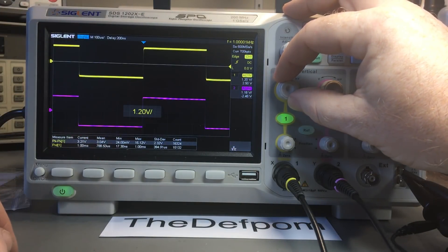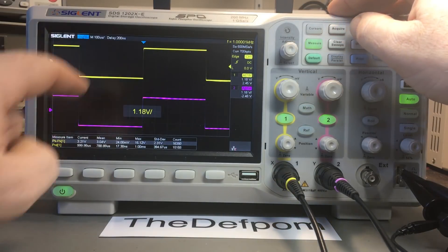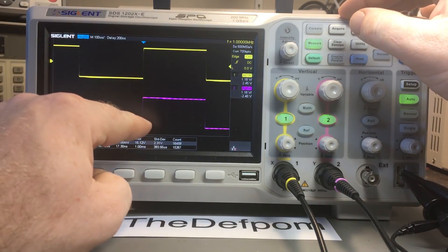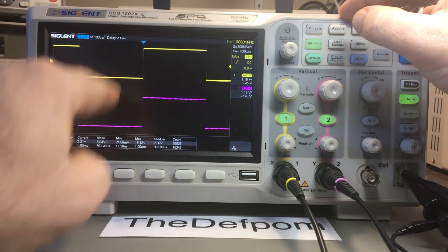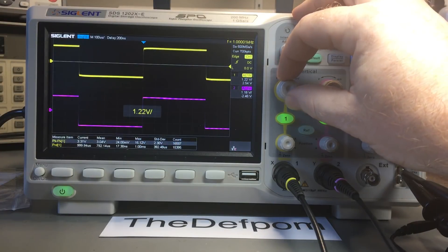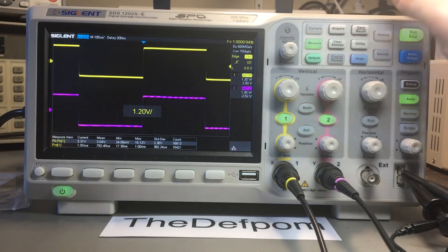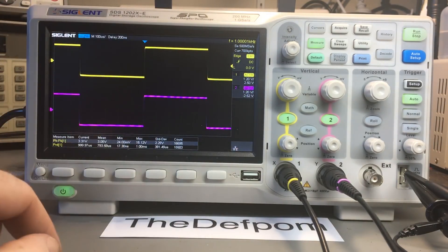Same on the other channel - exactly the same, no issue at all, not changing at all. If it's slightly off you can see there's a tiny bit, but this line here is perfect. Trying to get that balance between them is a little tricky, but it's almost perfect on both - it's linear, which is what it should be. So that is absolutely fine. Installing those capacitors and properly calibrating it does resolve the scope probe issue. The compensation works fine off the internal reference, which is where the issue was showing up.